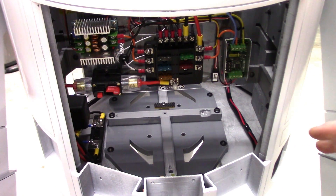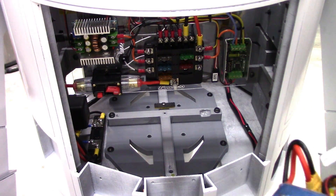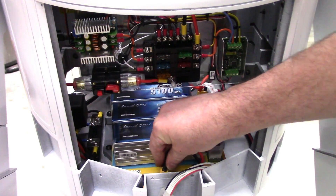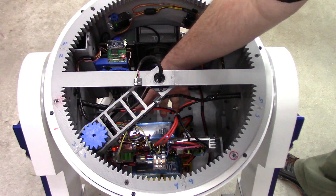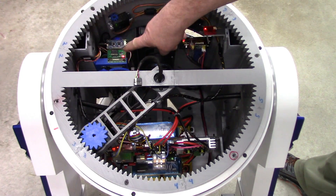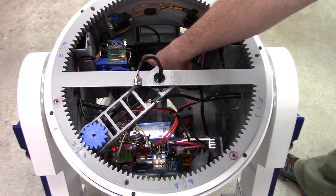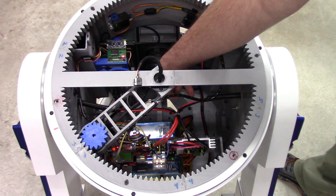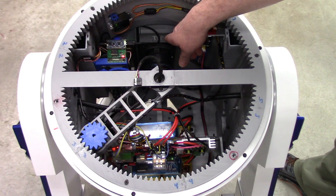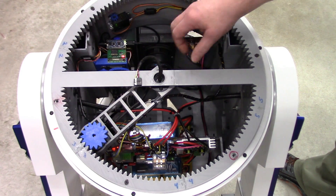The component board fit well in there - hopefully it works as good as it looks. It's wired up to the shunt and to the power relay. The battery tray fits in with ample room to access things. I've got all the rest of the front end electronics in - there's our soundboard and trigger, and the amplifier is below that on the panel. I made a little mount for my specific speakers using Tinkercad and printed it out in TPU so it's soft and rubbery, which deadens any sound vibration.